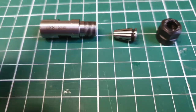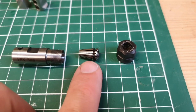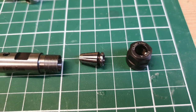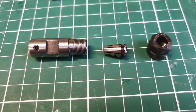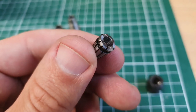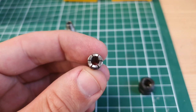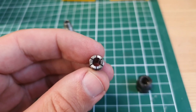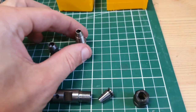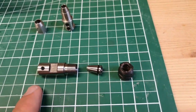The ER8 coupler has a 5mm input shaft and 5mm output, but you can also tighten a 4.76mm flex shaft without any problem. On advice from another hobbyist, I decided to try this coupler. This is the part that clamps down your flex shaft. Compared to the TFL coupler, it has more segments — six segments versus three for the TFL — which might make a difference.